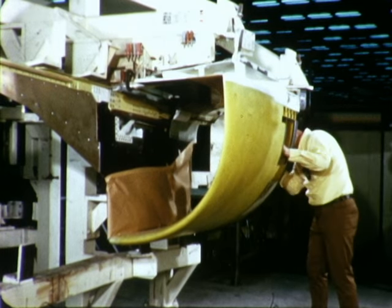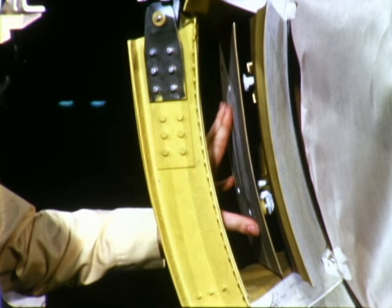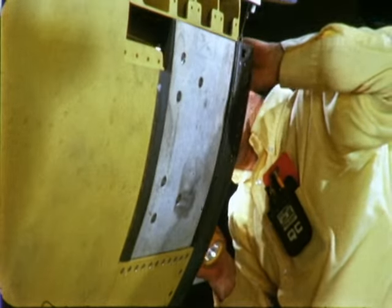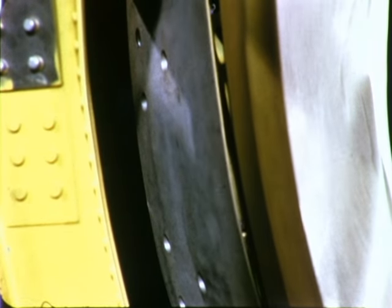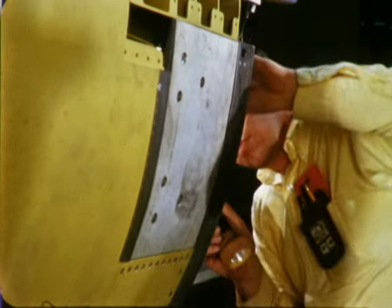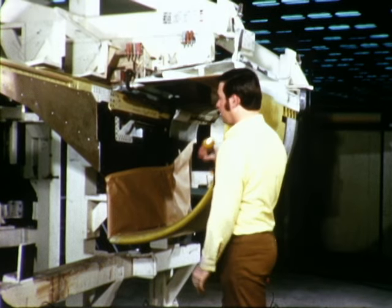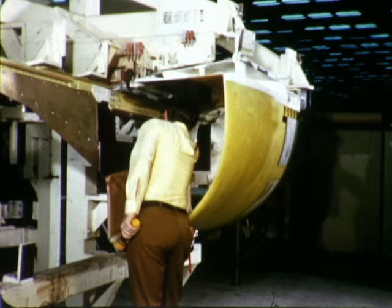Concurrent with the enlargement of the cowl, the previous cowl translation system has been replaced by cowl blow-in doors. These are free-floating, eliminating the hydraulic, pneumatic, or electrical actuation required for cowl translation, plus the attendant control and warning systems. In ground and takeoff or landing operation, the doors float open as the engine pulls the inlet duct pressure below ambient, thus admitting additional air of relatively high energy. As forward speed increases and duct pressure approaches ambient, the doors close. They are fully closed for normal cruising and higher speeds.